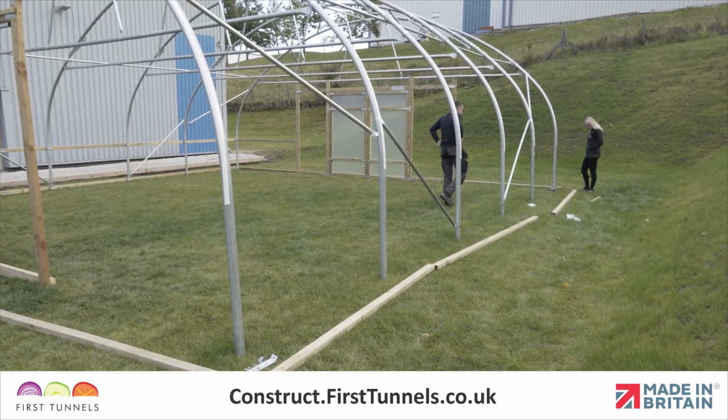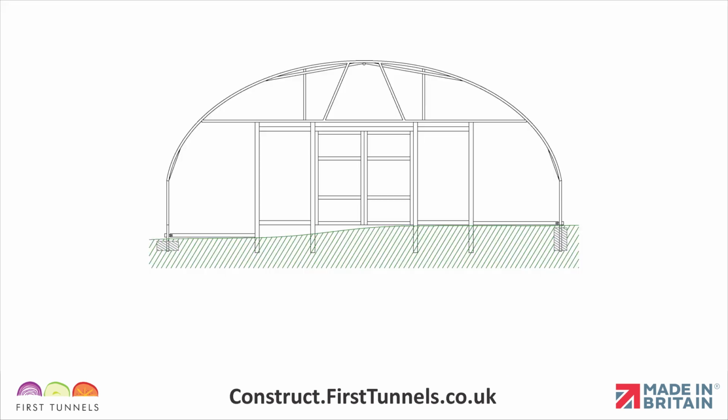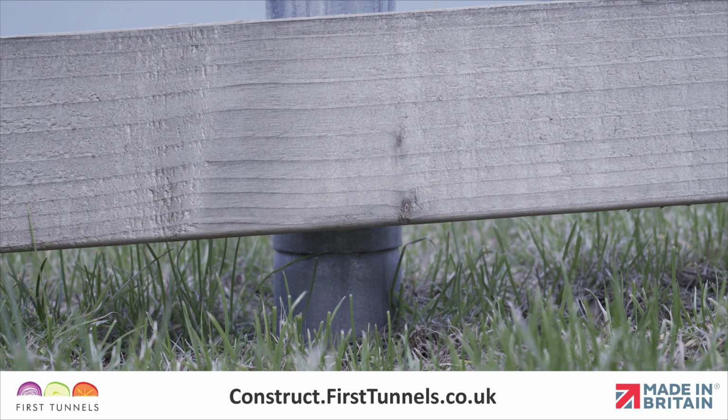We will start by fitting the base rail down the length of your polytunnel. If your polytunnel has a slope across the width, then we suggest fitting the rail on the side that is highest first. Your foundations will have been positioned at a consistent height, and consequently, the swage joint can act as an indicator for the position of the rail. Set the base of the rail in line with the joint on the foundation.